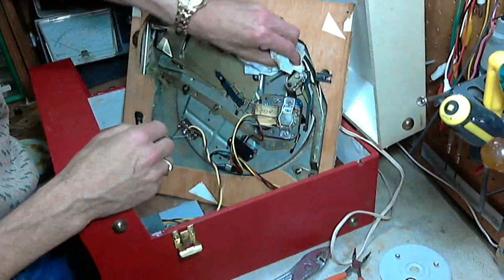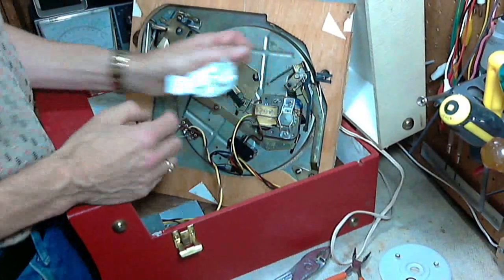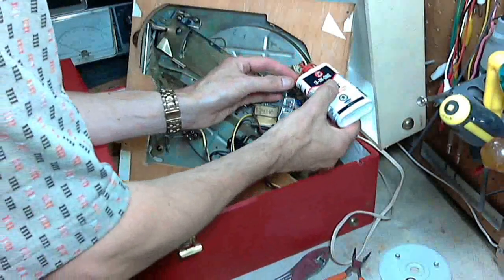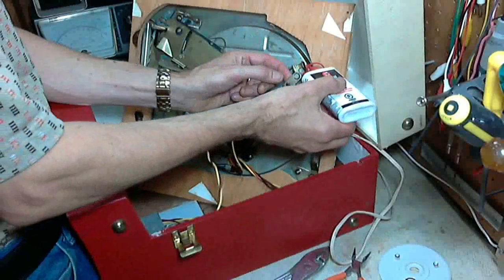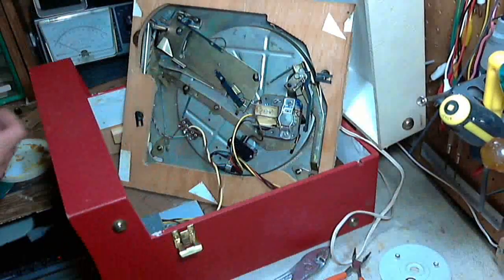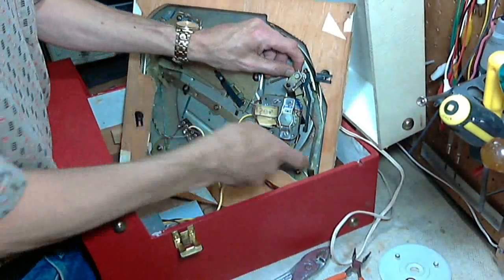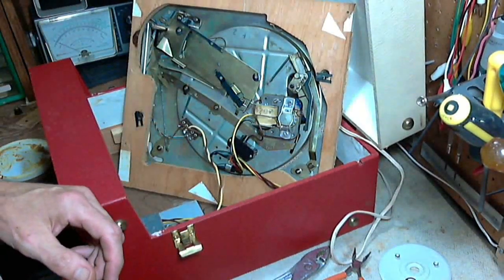Again, this alcohol will dry away and we'll get right back to the sticky condition. So I'm going to try to remove whatever I can here. Not much spring power in there. I'll put a little bit of light oil on that. I don't want to put too much. I think we've got that mechanism sorted out. The speed adjuster is moving really nicely now, but it's dry as a bone in there, so I'm going to put some of this heavier grease in there.